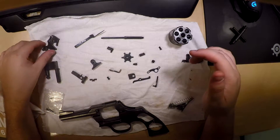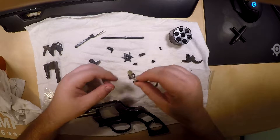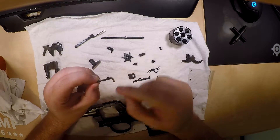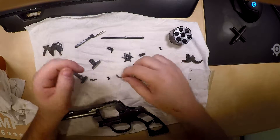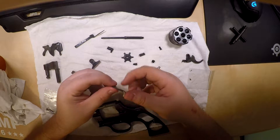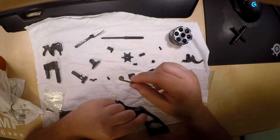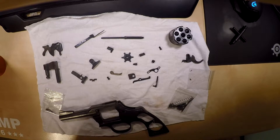So what we're going to do is put this back together. We have all of our internals. Oh, one more thing — for whatever reason, whatever material, this might be like a high nickel steel or something that this piece is made out of, for whatever reason it blued a tiny bit on the sides but it refused to blue on either surface. It could be surface prep, it could have been that I was holding it and got oils on it, or it could be material base. But I believe on a regular revolver these are all in the white anyways, and they're on the inside — so you're never going to see it, so I'm not too worried.